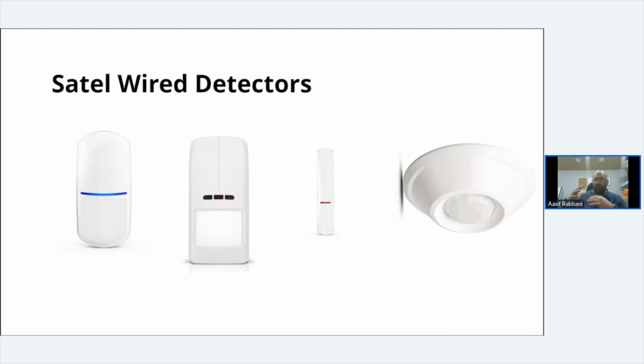I don't know if you know how PIRs work, but they send out a field of light vision. And a pet-friendly detector always has 2 lines, one that goes over and one that goes below. For it to work, both lines have to be broken. If you mount your PIR too high, then your detection area is up there on the wall or too far away from the area that you're actually detecting.